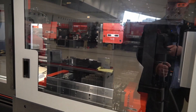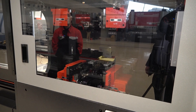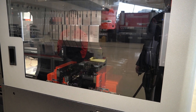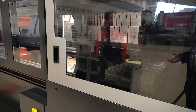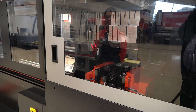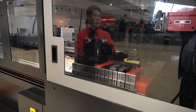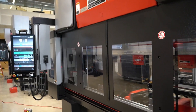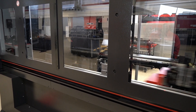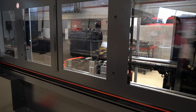I'm going to take a look in here while it's doing its job. There's something cool about watching this. If I was mass producing the first part, I would use this 2 minutes and 30 seconds to bring the finished parts to different locations. And here we see the reverse gooseneck that's going to be installed. It's rotating in the APC right now to reverse it — it was up on top. Here it comes.